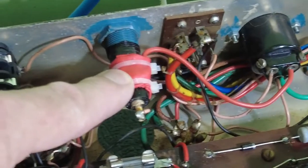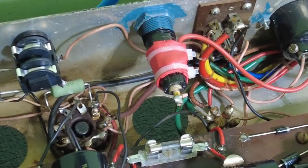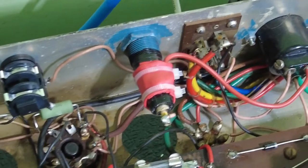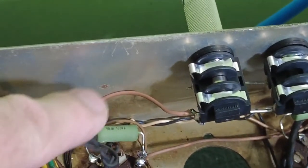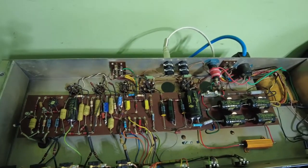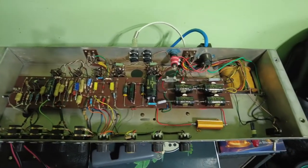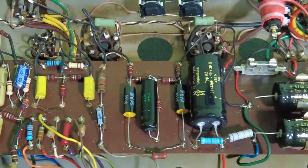The shrink tube approach clearly says 'this is insulated' rather than suggesting the fuse holder might be cracked — which is what the electrical tape implied. We've also put new screen resistors on — remember the one on this side was cooked and baked. That's all sorted. The whole amplifier is complete and in some ways it's almost like it was when new — probably better, because these F&T caps are higher quality than the originals. We've got Sprague in there for the bias — top stuff.